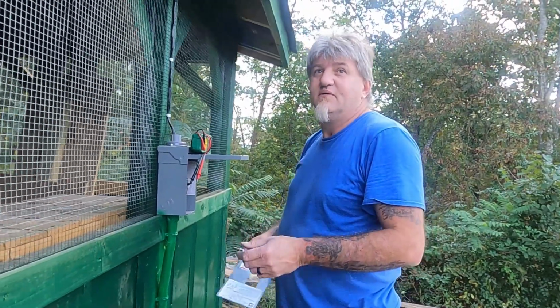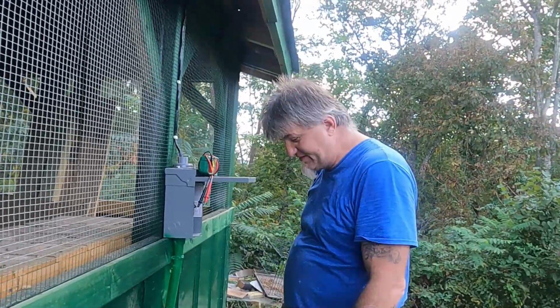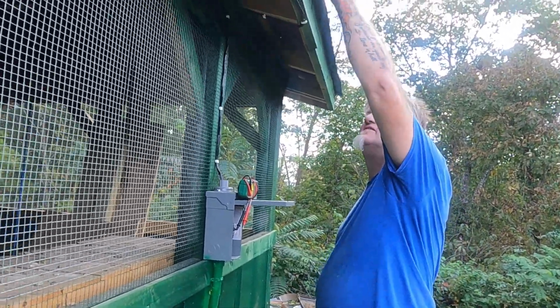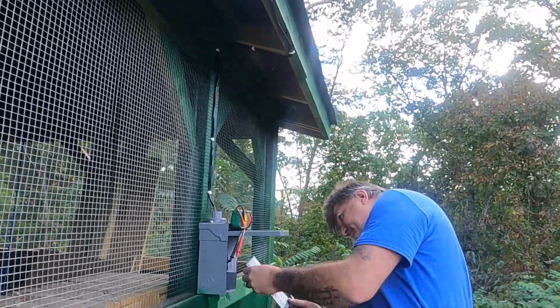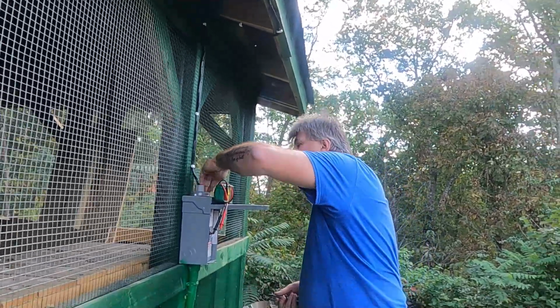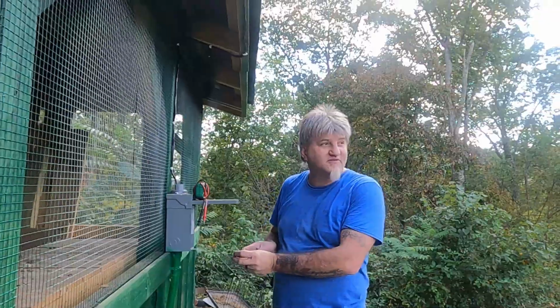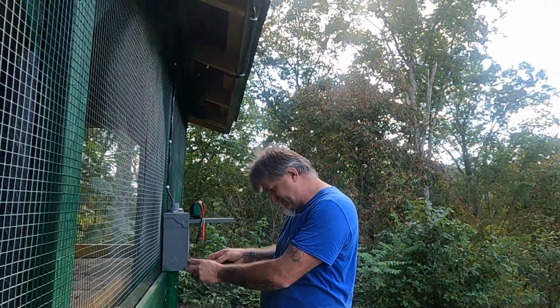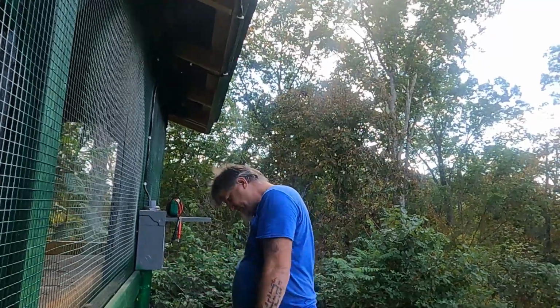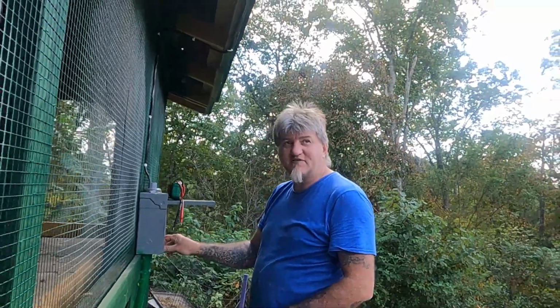We'll end the video here, but it's more troubleshooting. If anybody out there has run across this or knows anything about why my roof has got voltage on it, and it being grounded with four different grounds, I've got four separate grounds up there now, so it's not a grounding problem. Which tells me other panels are doing this too, and I've never been shocked by any of them. No, me neither. And it's not a single panel causing the problem, because if it was, it'd just be that one panel's voltage. It's the voltage of one whole string.